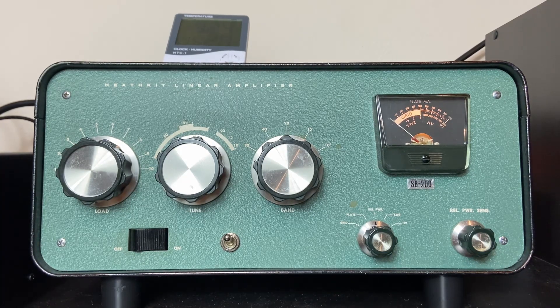The exciter is set now to 5 watts. Always load at your minimum output power on your rig. Remember, set your exciter at the lowest output power — in this case it's 5 watts — and the transmission mode is going to be CW, so every time that I key the PTT it's going to be like a key down, and that's going to give you maximum transmit power.